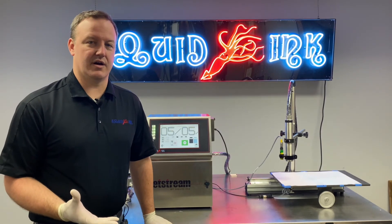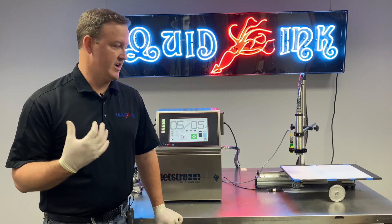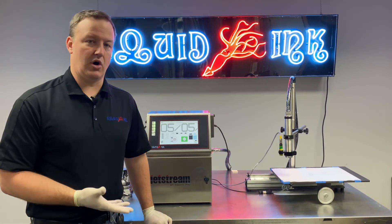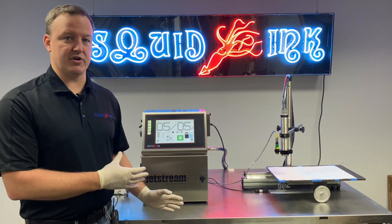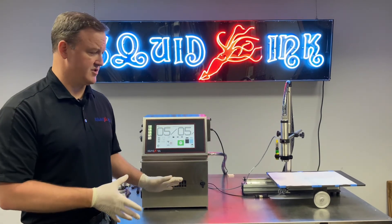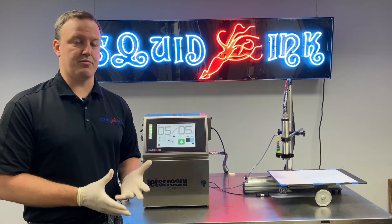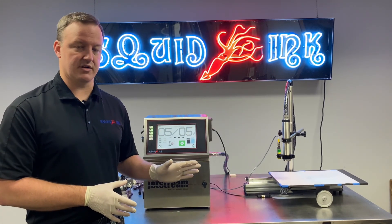One last point regarding adjusting or calibrating the modulation: if you're not seeing any response from the gun body — if you've worked through the entire modulation range and there's really no change, and print quality is just always poor — and assuming we verified all those precondition variables prior to making the modulation adjustments, if everything else checks out and you're just not having any results, it would likely then be time to troubleshoot the gun body itself. At that point, you'd want to watch our video on troubleshooting the gun body and make sure that it's actually functioning properly.